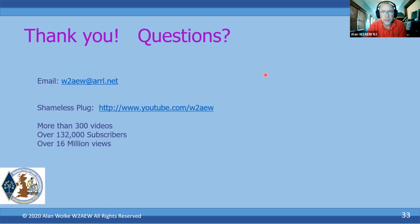So there was a question here from Bal, EA8BVP. Thank you for your talk. Can I measure an antenna VSWR if the NanoVNA is using ladder line? Well, it's still going to show you the input impedance looking into that ladder line. You may have to just solder up an adapter to get in there. If you're using the ladder line as part of an impedance transformer, or if you're going to put a balun on it, you can certainly do that, because if the antenna is not matched to the ladder line, the impedance looking into the ladder line is going to depend on frequency and line length. So it could be anything, right? Certainly it's still going to show you that impedance, so you certainly can do that.